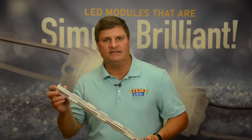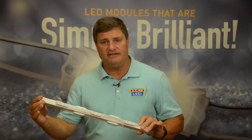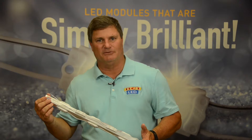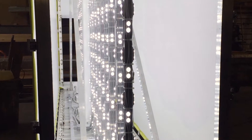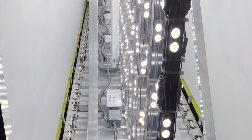Now let's look at the same idea, but in a 24-inch box sign application. For 24-inch box signs, we have a four-sided LED lightstick. This stick actually shines light 160 degrees from every module and actually creates the same light as produced by a fluorescent tube. We now have our LED light modules attached to all four sides of the lightstick, and now we position the lightstick.